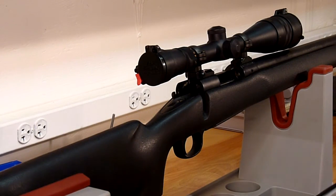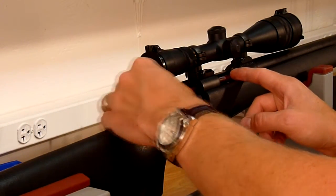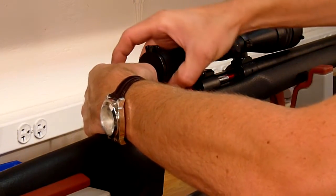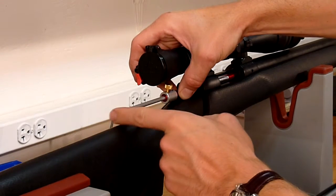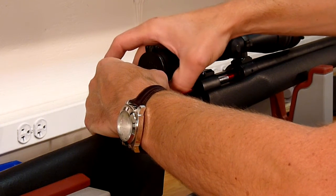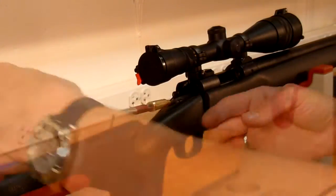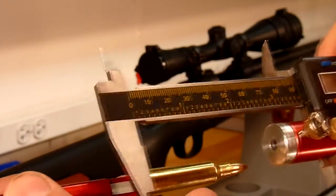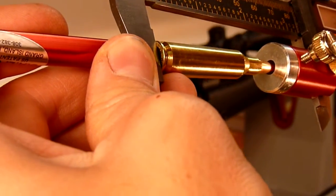So let's see what happens here when we take our measurement. I'm just going to insert the cartridge overall length gauge until I feel it gently bottom out in the chamber. I'm going to loosen the lock nut, and then I'm going to tap the gray rod until I feel it gently snug the bullet against the lands in the barrel. We can now take the Hornady Lock and Load bullet comparator kit and take an overall length measurement with this kit, being careful to center the bullet